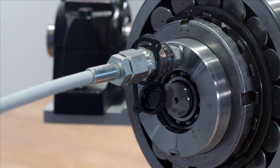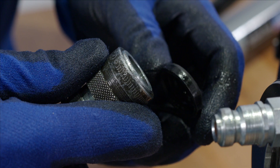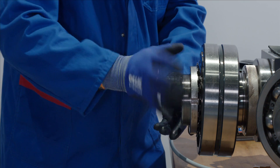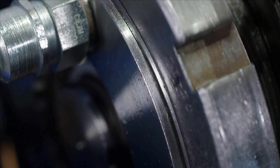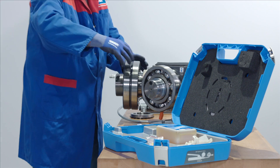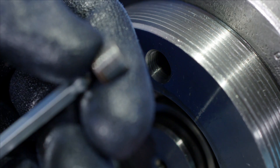When enough oil is introduced, it will form a barrier between the bearing and the shaft, breaking the interference fit. At that point you will hear a loud bang. The bearing can now be removed from the tapered shaft. Disconnect the hydraulic pump and place the dust cap back onto the hose. Remove the locking nut and then the locking ring.